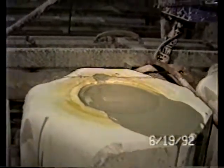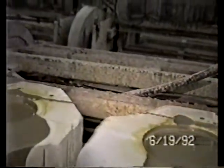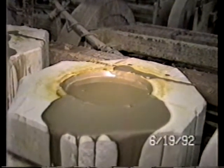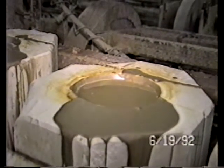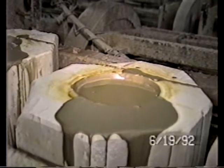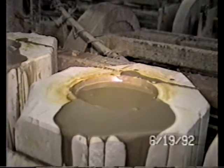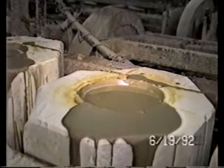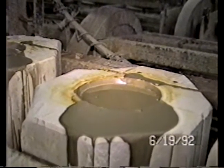Here's an example. The mold is filled and actually spilling over. And going back to the earlier molds filled, you can see the volume starting to recede and drop down. Well, you can have the fill head come back automatically immediately after filling, or you can have it indexed back, stopping at each of those micro switches and refilling to top off whatever's been absorbed.